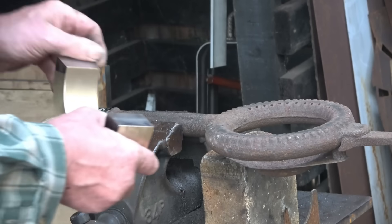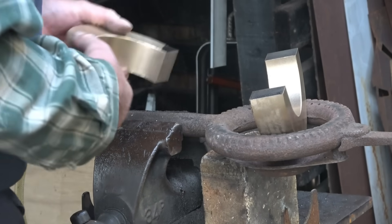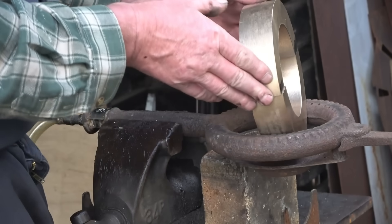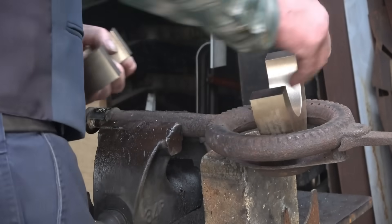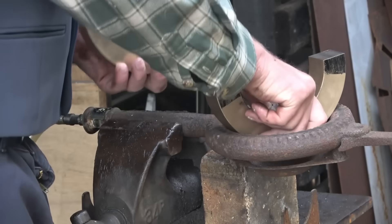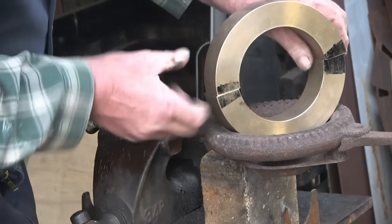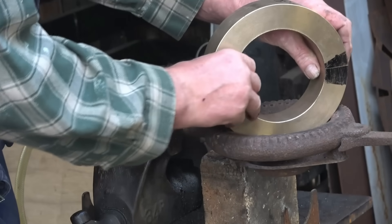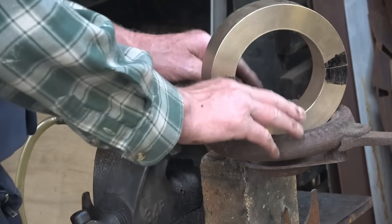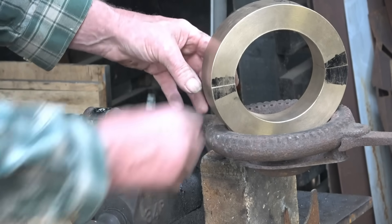I have got a job here to do. I've got to solder these two pieces of bronze together — soft solder — and then these go into a lathe and they're machined into a mechanical seal. I'll use this gas ring to preheat them, lift one up on top of the other. This is going to make a big difference to warming it up, saving on the oxygen for the propane torch.